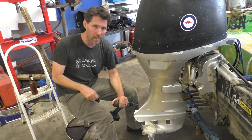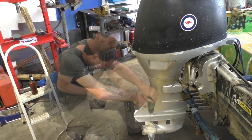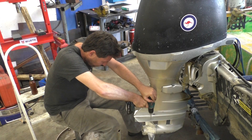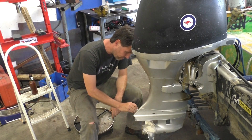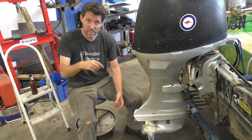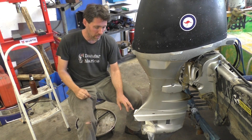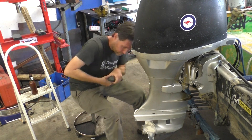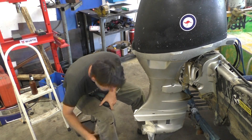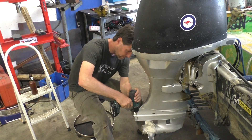Aluminium's pretty soft — I'm not worrying about having oil and slow-speed drill and all that kind of thing. If I do a test fit on these bolts, they're still a little bit tight. You can definitely tap a thread through, they're not too tight, but the idea is they push through, so I'm going to go up to 6.5mm. Yeah, that's good now. So 6.5mm it is.